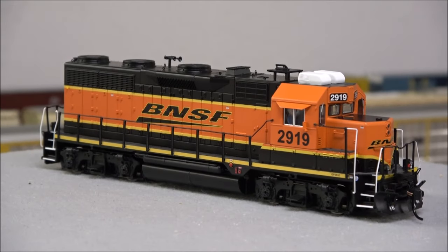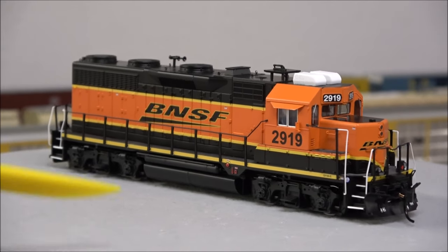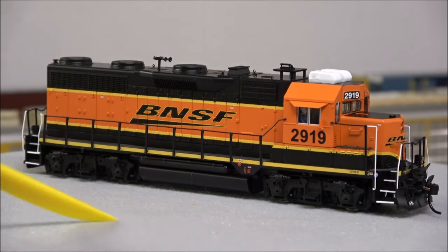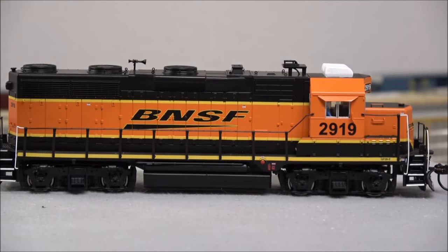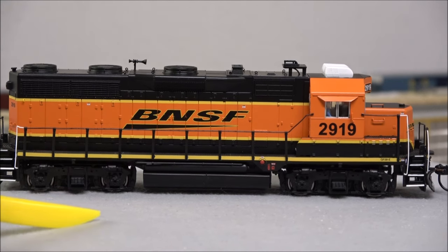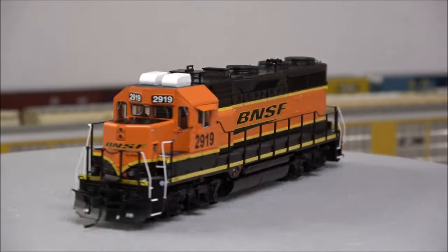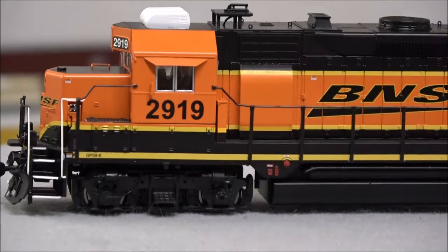Okay, let's take a look at this locomotive, the GP35. This is a modern BNSF swoosh scheme, again with the air conditioning units. Those are dual air conditioning units on the roof, as you can see. There's also an antenna stand with a Sinclair antenna, exhaust, dynamic brake fan, exhaust fan, or I'm sorry, radiator fans. And then the horn is also pronounced up top here. Yellow sill for the reflective post 2006 FRA standards. And we'll swing around to the front and really zoom in here.